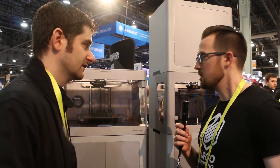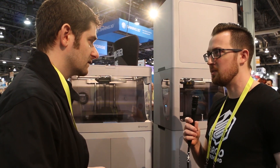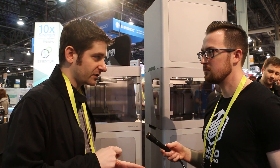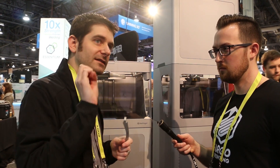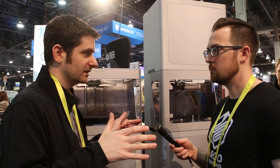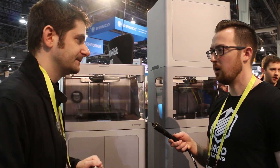Aside from carbon fiber, what other engineering materials can go into the nylon? You can do carbon fiber, Kevlar, and fiberglass. Carbon fiber is the highest strength-to-weight. Kevlar gives you abrasion resistance. Fiberglass is electrically inert and offers the highest strength-to-cost ratio. So if you're making RF dishes and want to send signals through them, you'd use fiberglass. If you want to keep signals in or need good heat conduction, you'd use carbon fiber.